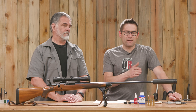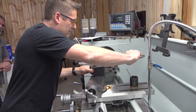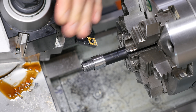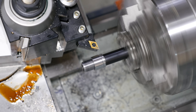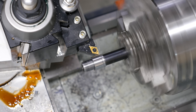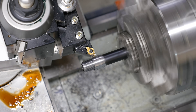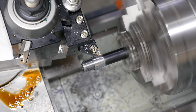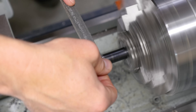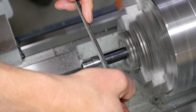We have a nice transition. After we got the diameter where we wanted it, I set the compound over to 10 degrees — so if the compound is perfectly parallel with the spindle, we're just 10 degrees back from that. That gives you a nice slope. We cut that to kind of match the profile of the barrel down to .655. Then we went on to filing and sanding to get that surface finish really nice. And it did look great.